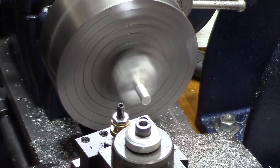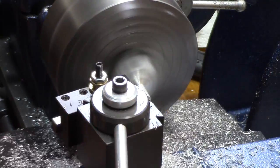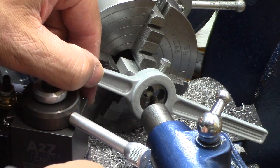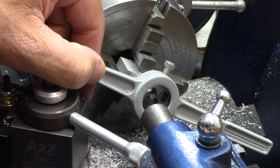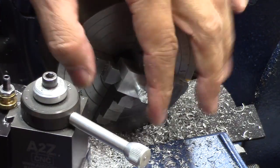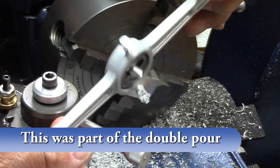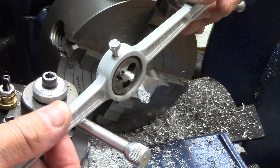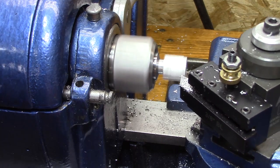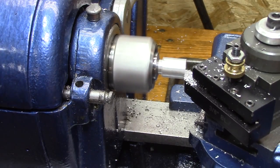Right now I'm just taking it to the dimension to get it for a quarter-twenty, and I'm going to run a die over it. And then I couldn't get it to work. That ain't gonna work. This was some of the leftover metal — a double-pour piece. When I poured some aluminum in a can, I let that kind of harden up and then poured another on top thinking that would stick it together. Well, it doesn't. That was right at the fault line, and that's why it failed.